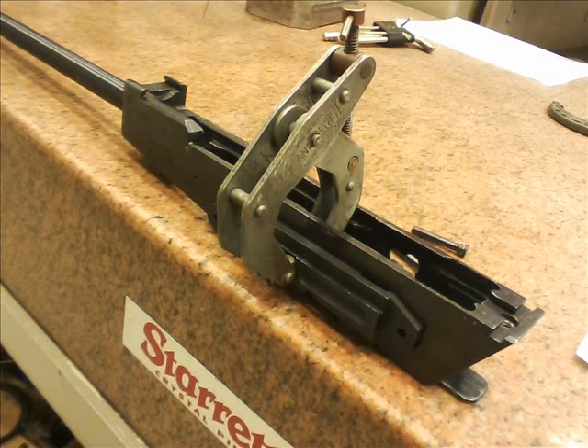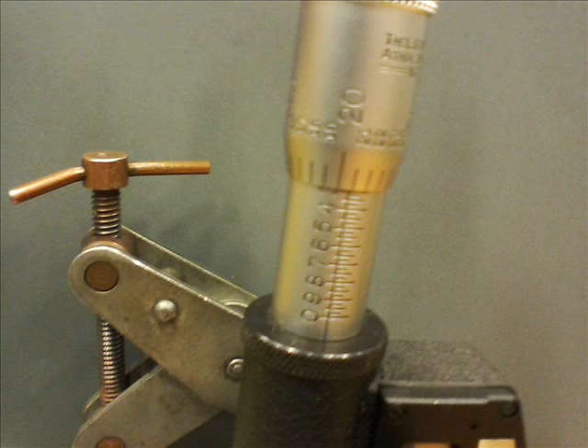As you can see here, I had the side scope rail attached to the rifle with a C-clamp. I was using the C-clamp to hold it on as I checked the height of the top rail to the top of the scope mount with a depth micrometer. The top of the rifle is indicated by the red arrow and the top of the rail is indicated by the blue arrow. You want to get it within 1 to 3 thousandths, because the sides of the scope rail are not necessarily parallel to one another. That's my measurement shown on the depth micrometer right there.